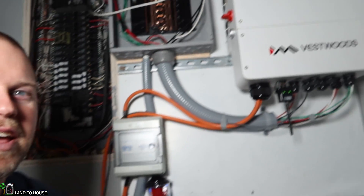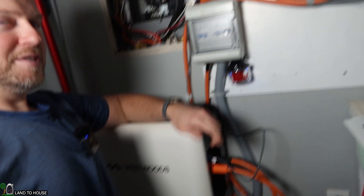I hope you found this video helpful on how to install the midnight solar SPD. I have this here to protect my expensive inverter and also this whole house battery down here. It's real simple — just hooks up to your solar and directs down to ground. Basically any voltage above 600 will be clamped down and sent to ground, and it will hopefully protect my expensive equipment. I'll have links to this one right here in the description down below, so if you need to install a surge protection device on your solar setup, you can follow this video and purchase from that link.